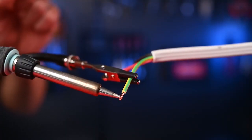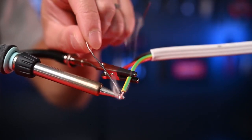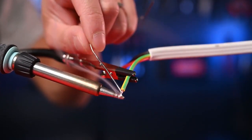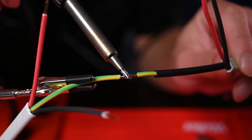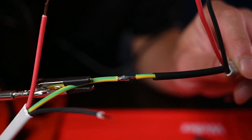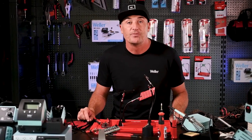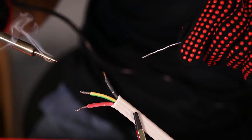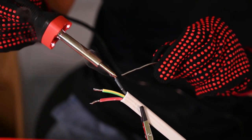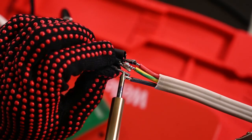The most important tip that you will hear today is to remember that you want to heat the metal components, not just the solder. So hold the tip against the metal components for a few seconds, and then once hot, add your solder. As the solder melts, it will flow into the gaps it needs to fill. Continue to feed solder in until a sufficient amount is melted. While you need enough to form a good solid connection, you don't want to have too much either.